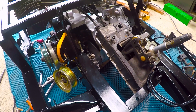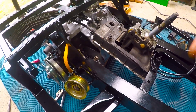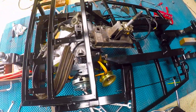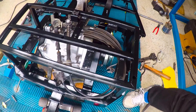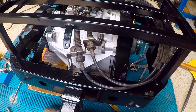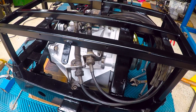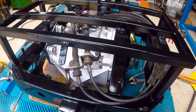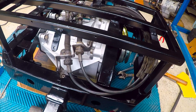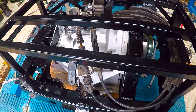Originally I had a solid shaft, and once I started to build it - as you see in earlier videos - I quickly realised that it just wasn't going to steer properly. At that point I figured I'd need to either have one wheel driving or come up with something else, and one of the things I wanted was to be able to reverse as well. The rear end from the mower was just pretty crappy - the axles weren't big enough really for what I wanted to do - so I started looking at gearboxes out of cars, like this one.